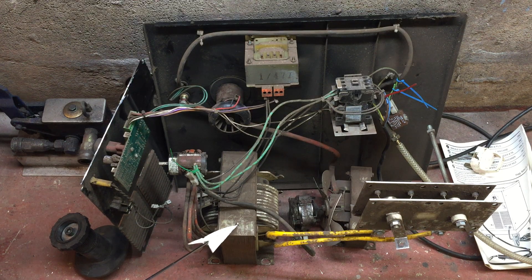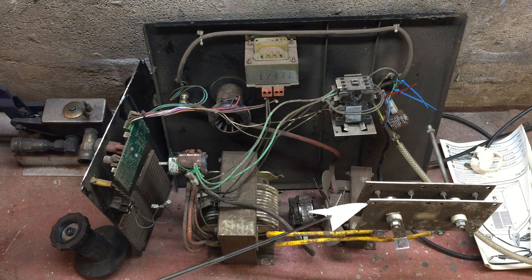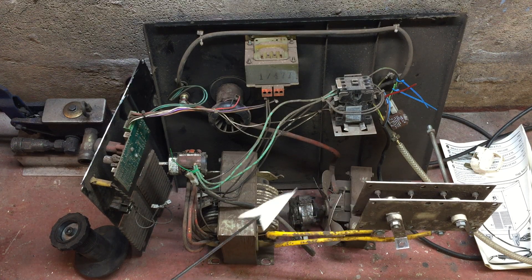So why is it in a million bits? I bypassed the rectifier part, which would have turned it into an AC welder from a DC welder, and I was getting exactly the same fault — the wire would just suddenly glow a bit, it wouldn't spark, and then it would cease function completely. I would tend to think the problem is in this transformer here, the heart of the machine — that there's a broken wire in there somewhere. These secondary wires are thicker because they carry high amps, while the primary wires only carry around 13 amps. As soon as it sees any load, something thermally moves and disconnects, and you don't get any spark anymore.